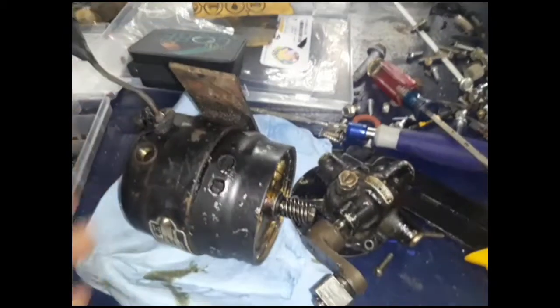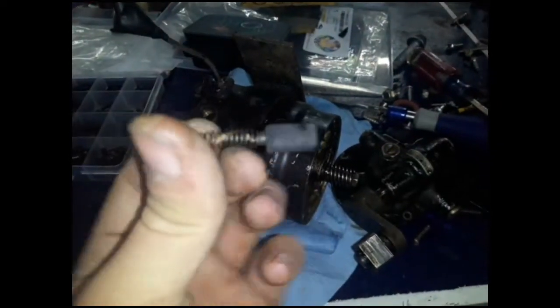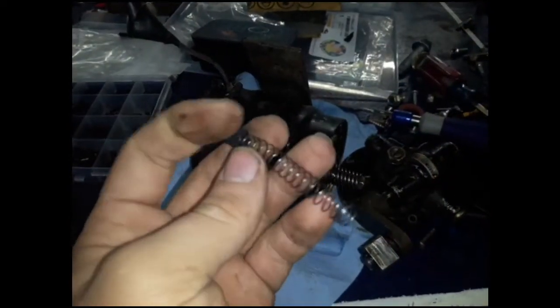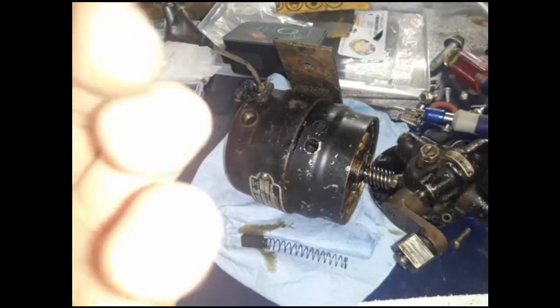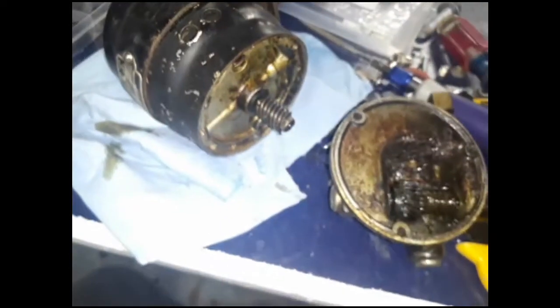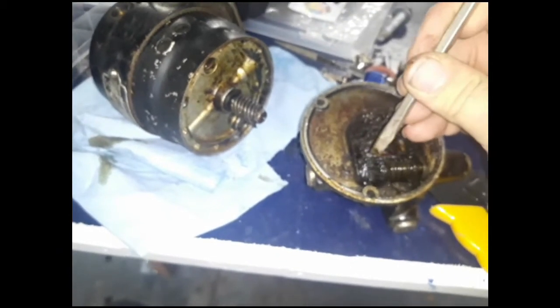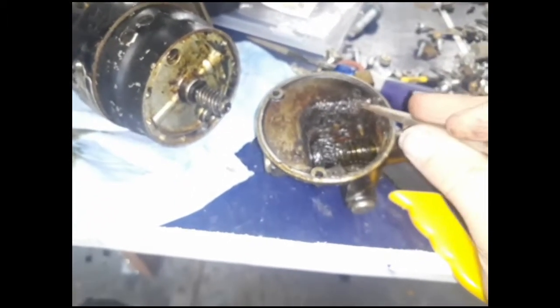I took the Do-More motor out of the rotary merchandiser because I jumped it to AC and it didn't work. First brush looks pretty good. The second brush is really weird — it looks like someone took the metal wire out but there's no hole where one used to be. I pulled off the gearbox to re-grease it, and this motor is seized completely. The grease in the gearbox has turned to absolute glue — possibly 90-year-old grease.